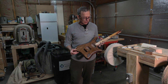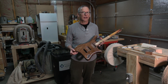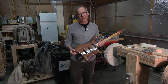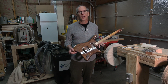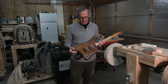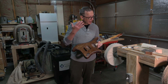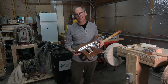However, if you're not in any big hurry, I think it's probably an option you could consider. But if you're in a production setting and you build a lot of guitars, this is not the approach you'd want to take. In fact, this will be the only guitar body I ever put this stuff on. I'll never clear coat a guitar with a bar top epoxy resin, only because I have spray equipment, a buffing machine, and I can apply other finishes that are so much easier to use.